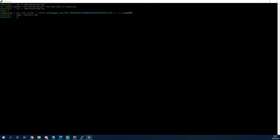Don't delete the one in your text editor yet. Keep that one, because we're going to go back over to the printer and plug in the one for the MCU-Z. That's the one with all the Z motors plugged into it, so go grab that one. Now with MCU-Z connected, hit up arrow twice. That gives us our serial command. And now we have two.